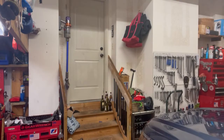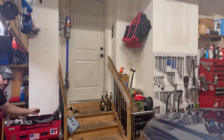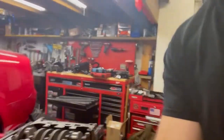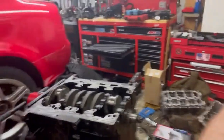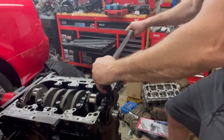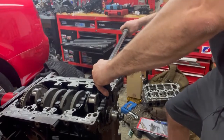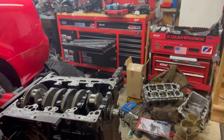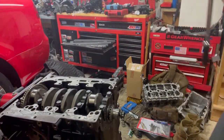All right, now we're going to torque it to 65 newton meters. Let's get the half-inch torque wrench. Here's our torque wrench, and then we'll rotate this way. Not a huge deal — you've probably seen somebody torquing bolts before. Again, 65 newton meters.